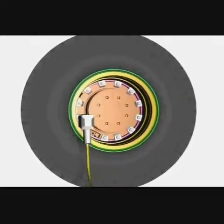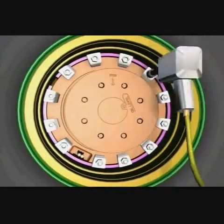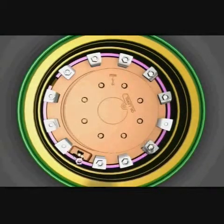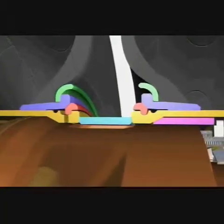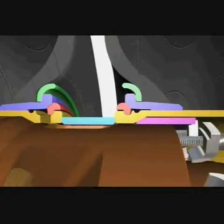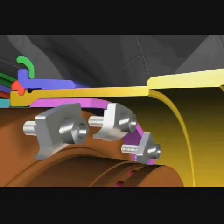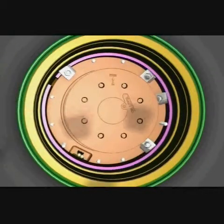The possible sequence of events is now shown. Mr. S. Davis loosened all of the nuts using a rattle gun. The nuts and cleats were removed from positions one and nine. The crack in the rim base is shown opening in slow motion. The broken gutter section of the rim base, lock ring and wedge band are forced into the loosened cleats, shearing six of the studs and bending the remaining four out of the way.